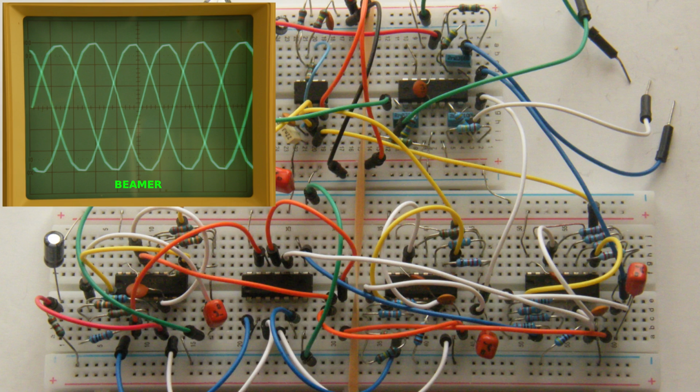If you were to try and connect it to any rotary transformer, 3-phase, synchro servo, that sort of thing, it would need a power amplifier in between. That would be 3 power amplifiers.